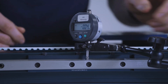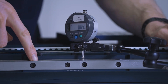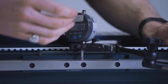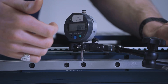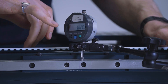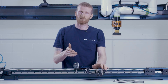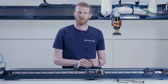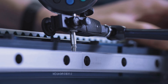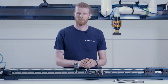Once you've mounted your dial indicator, we're going to approach the joint position. I've positioned the dial indicator so that it's inside the bearing race on the top corner closest to you. It doesn't really matter if your dial indicator is set exactly to zero, because we're looking for the difference between before and after the joint. Right now we're measuring minus 0.04 millimeters, and if I go across the gap, now we're at minus 0.02 millimeters — that is within the specification of 0.02 millimeters for the alignment of the joints. This process will need to be repeated for all four races on the rail at each joint along the butt jointed rail system. With that validation complete, your butt jointed rail system is in specification and you're good to go.